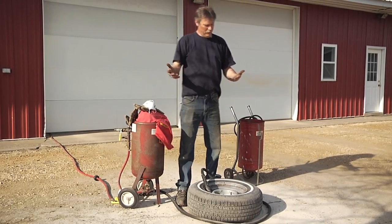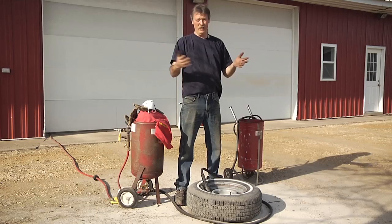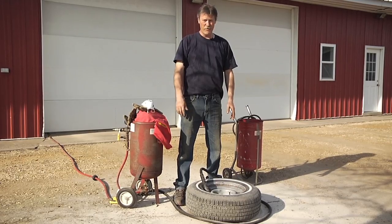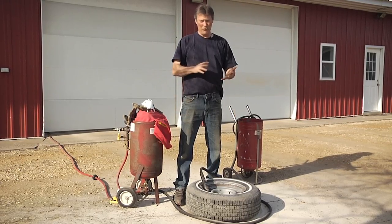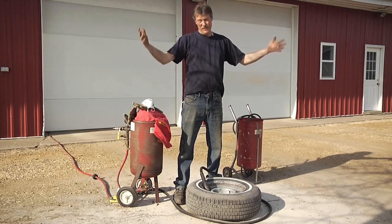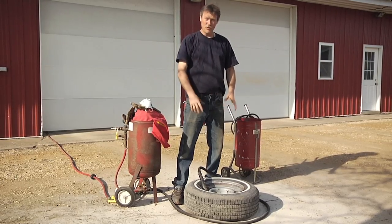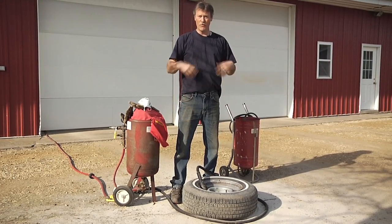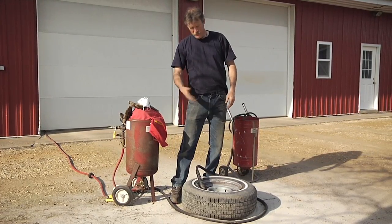Another thing: if you're in the middle of a city you probably don't want to be blasting in your driveway and spraying it off into your neighbor's yard. There are a lot of places to do it commercially. You can also get blast cabinets that are fairly substantial in size — you could probably fit a rim in some of the bigger ones, not maybe with the tire on — and with blast cabinets you can reuse the media.